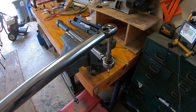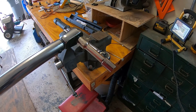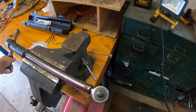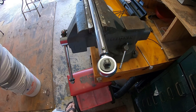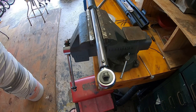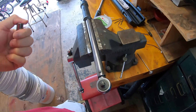Maybe half a foot-pound difference — somewhere around there. It's actually probably pretty close to being in calibration; maybe I just had the thing set wrong or used it wrong. This thing is close enough that I don't want to mess with it and possibly make it worse. That's a pretty easy way to check a torque wrench if you have one you know is good.